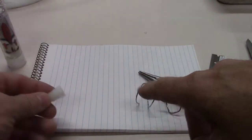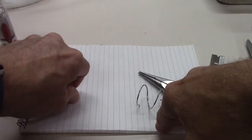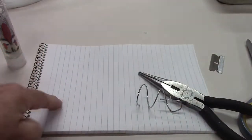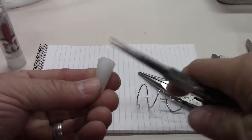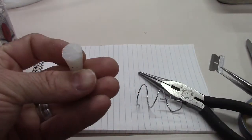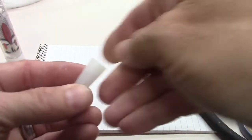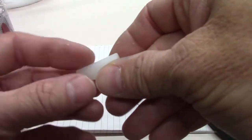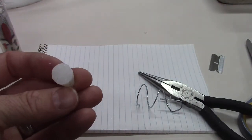They'll firm up. Now, the paper is good for if your plugs come out and they're a little sticky, you can just roll them on the edge of the paper, and that will take the resin off of the plug and stick to the paper, and then they're good for next time. Another option is take your pliers and just do this around the edge, and that'll remove any excess resin. You don't want to damage the plug. You don't want to pull it apart. You just want to kind of rub against it to get that resin off. It's not going to hurt to have resin stuck to the tube for next time, as long as it's not loose and falling into your cast. So this is ready for another use.